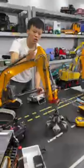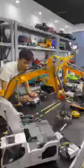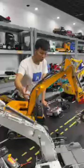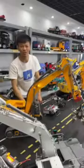If at the same time you keep the small arm dropping and want to rise the big arm, you don't have enough pressure for the big arm. But with two pumps, this second pump directly supplies oil only to the big arm, so the pressure from the small arm will not mix with the big arm. So you can operate any motion mixed together without a pressure problem.